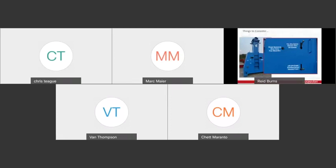Now, the potential pitfall here is when you have 4 legs of gantry, but they aren't all set to the same mode. And this, folks, is when disaster can strike. So, for example, let's say that you're lifting a load and you've got 4 legs, but legs one, two, and three are all set to lift because you wanted to lift. But 4 is mistakenly set to travel. So when you start pushing fluid to that 4-leg arrangement, you'll have 3 legs start to try and come up, but that 4th leg is going to walk out from beneath the system.